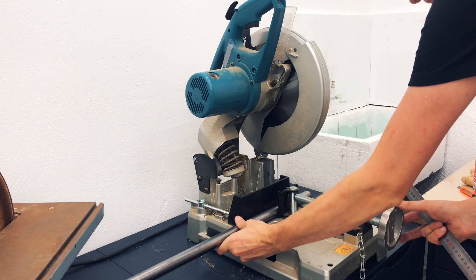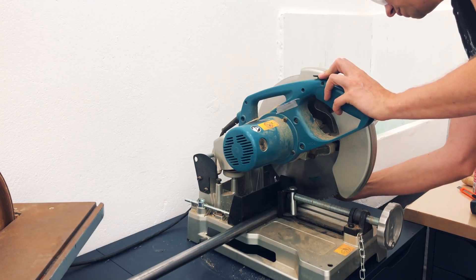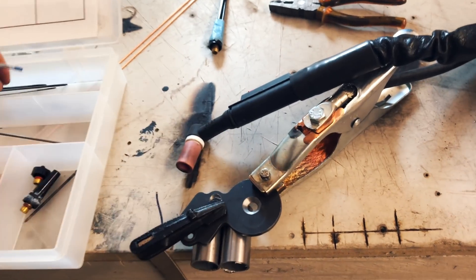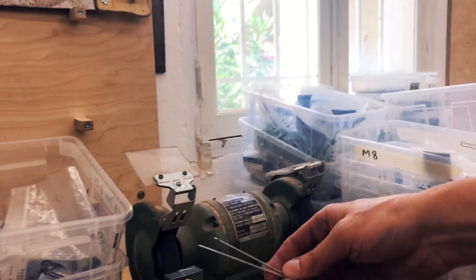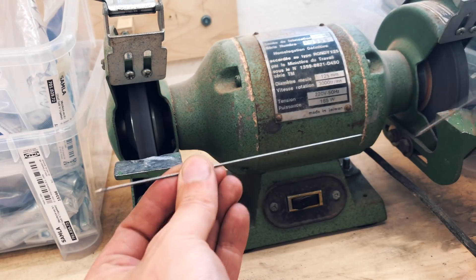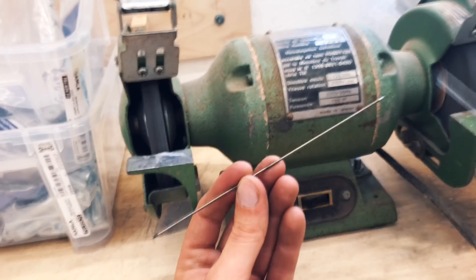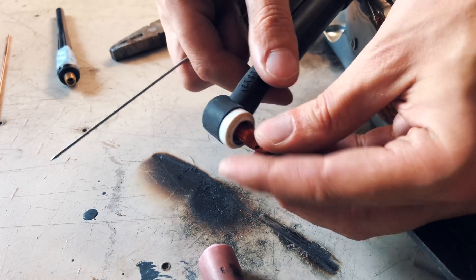I'm going to be a little inspired by Frank Howard in how I put this together — I'm going to make it oversized and cut everything clean. When I have welding inspiration, I never have fresh, good tungsten tips. The best trick ever that I learned from Marius is that when you grind your tungsten, you can grind both sides. Starting with the TIG weld, I only made a tip on one side. But what's genius is when you get this side contaminated, you don't have to run down to your grinder — you just flip it 180 degrees and you have a new tip. Genius.